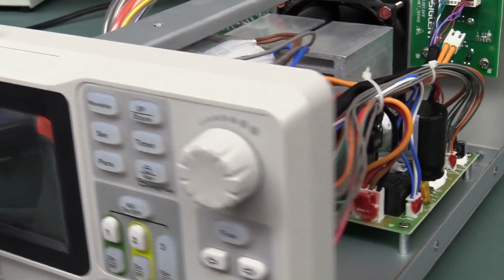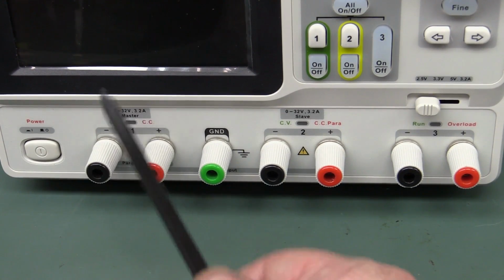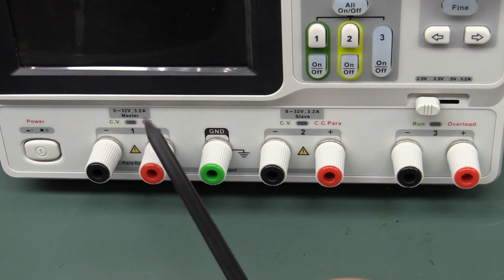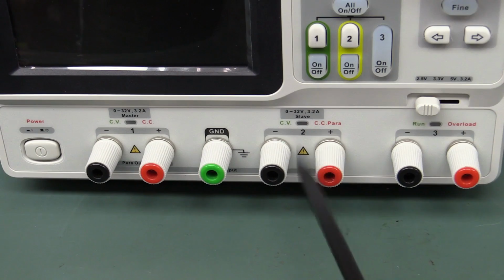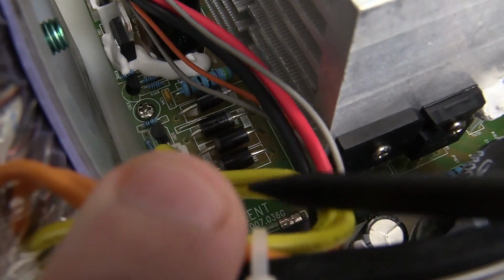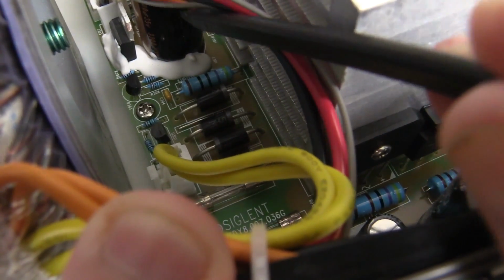So in theory, the power output from here is coupled into the heatsink. For example, I'm going to assume it's channel 1 here, so in theory you'll get less maximum power output from channel 1 than you would from channel 2, but the specs are the same, but that heatsink will actually heat up more than the other one. But as long as you design that in, there's no problem with that. I'm just pointing it out. And sorry that I'm not going to take this whole thing apart. I don't really want to go to that sort of effort,